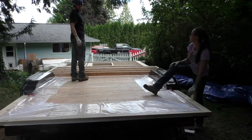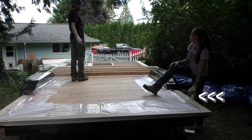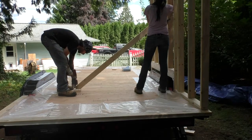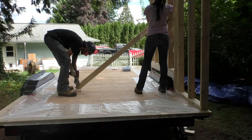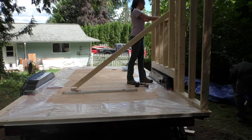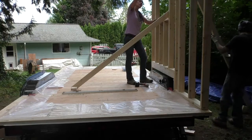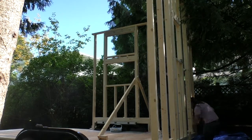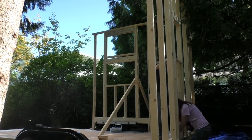When raising the walls, we did a few things to ensure they'd stay up. Before raising, we attached blocks to the outside of the bottom plate just to keep the wall from slipping off the trailer as we lifted it. We screwed a block of scrap wood into the subfloor in order to attach a brace to the wall. We staked a couple of wedge-cut 2x4s into the ground to attach bracing to as well. We also attached the walls together with a few screws and fastened a few screws into the previously installed bottom plate just to make sure everything was going to stay put.